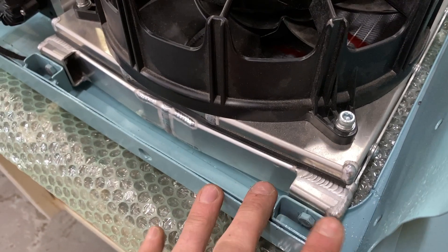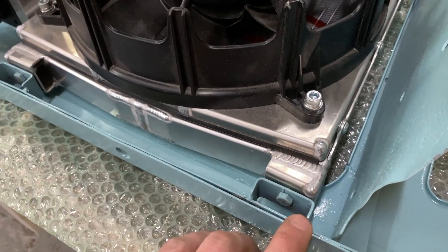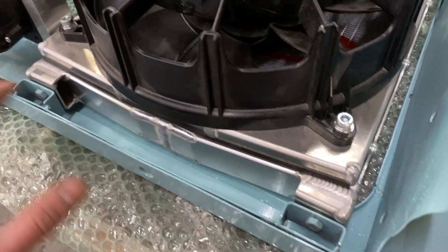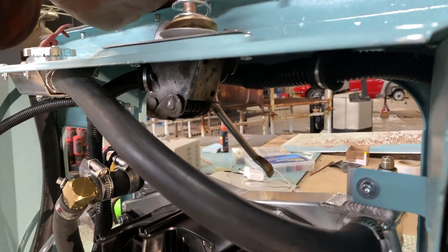There are captive nuts in the four corners of the radiator which allowed us to build and weld in small support brackets and put a bolt at each corner to hold up the radiator. This means it fits really nicely in the front of an old Land Rover and importantly gives us continual access to the bonnet release mechanism at the front.